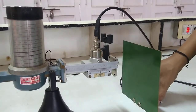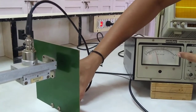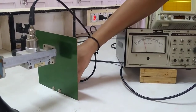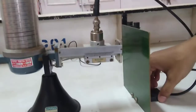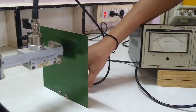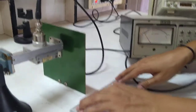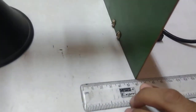This time the distance between adjacent minimas is not λg/2 but rather λ0/2, because the wave is now in free space — the waveguide is open and the reflecting sheet is outside. If I move the sheet you can see the VSWR meter needle moving from minimum to maximum position. You have to catch the distance between two adjacent minimas. Make sure the reflecting sheet is placed at right angles to get accurate results. The first minima reference is set at 6 centimeters.